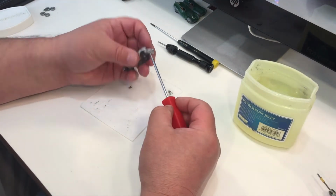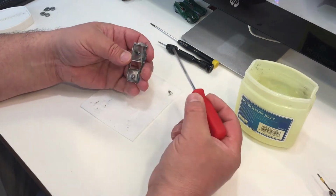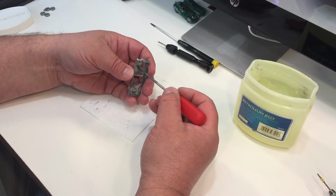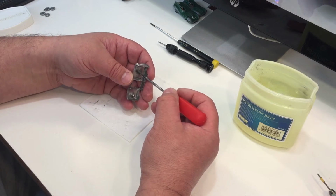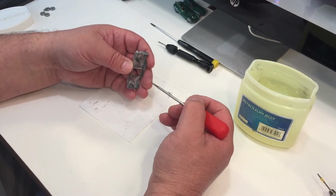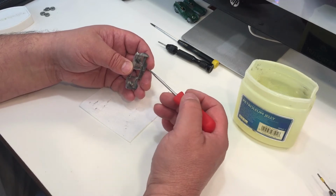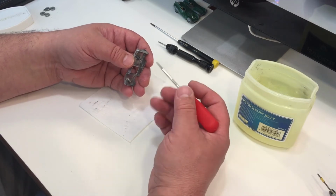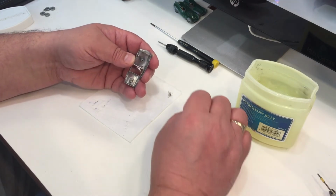So what's happened in this scenario, although I haven't gone through the bonnet, the original stud that was put into the post hole went in only quite shallow, and not long after starting to drill it, the drill went through very easily. So you've just got to take your time. It's all right going hell for leather and drilling on a fast speed, but you lose that control. So just a word of caution there.